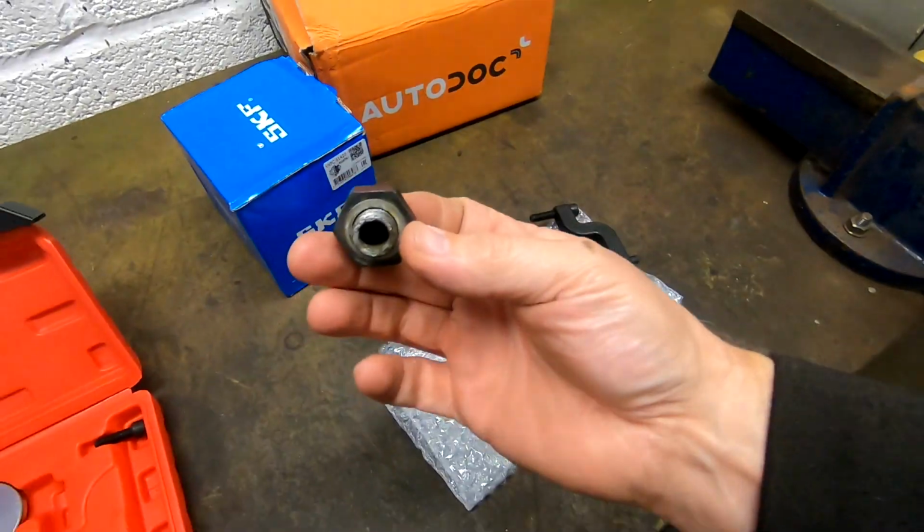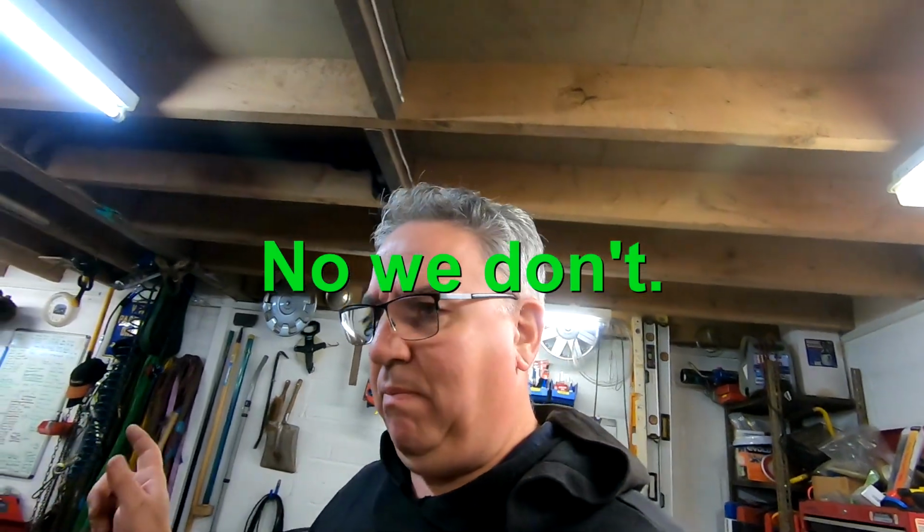We'll take the sensor in the bottom of the radiator out and drain it from there. There is a plug on the back of the engine, right beside this thing, that drains the back of the engine. And I think we might have to take the oil water cooler pipe fitting off, I'm not sure. Whilst that's draining, we can get it on top dead center or 90 degrees from top dead center. Then we can get in there and have a look.